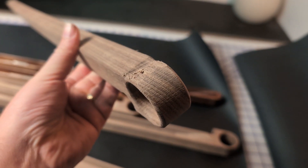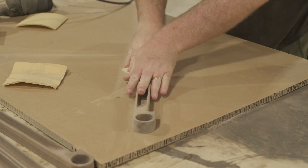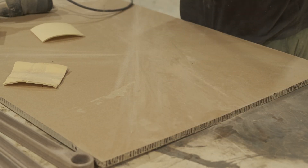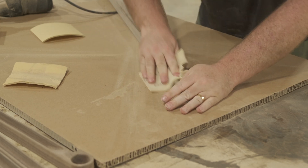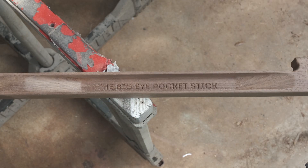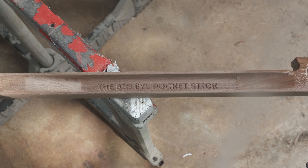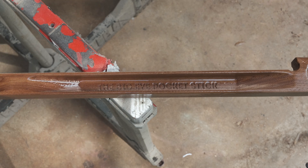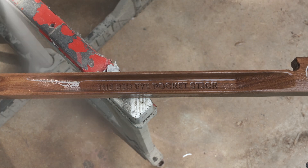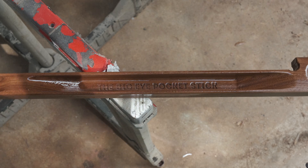To do my round over I left everything on the CNC machine. I used the orbital sander to knock down any tool lines, then came back with foam-backed sandpaper for all the detail sanding — especially with all that fluting, the swoops and bumps — and it made for a really nice result. If you have a favorite spray clear just out of a can, please leave a comment down below. I come from a world of table finishing where I used to mix up catalyzed varnishes that were high solids, and you will never get something in a can that compares to that. So if you have a favorite spray can, leave me the brand name and I will definitely try it out.